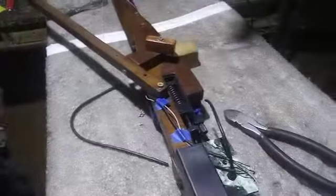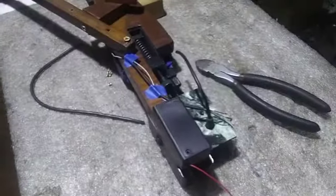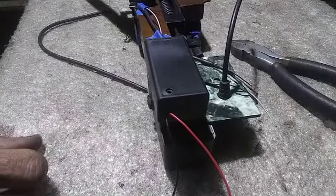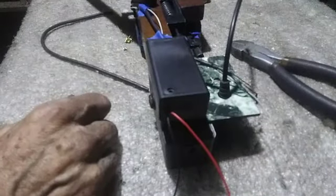Then let's see, over here on the electronics, I'm going to take a slightly different approach. Typically I'll bring everything together and wire it all up to the first switch and then send it to the next switch and then send it to the next whatever, that kind of a thing. And this time what I'm going to do is take everything and send all the positives to one spot and wire them all together, and all negatives and wire them all together. And that'll make it a little easier.